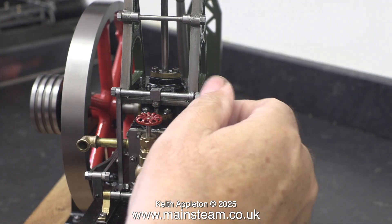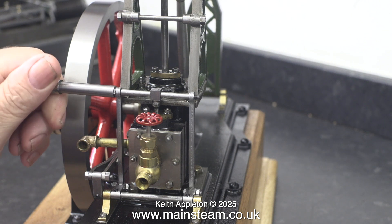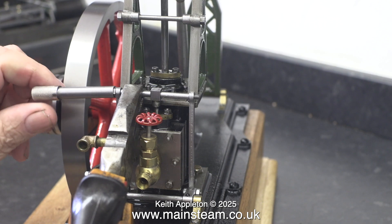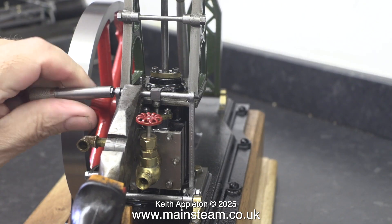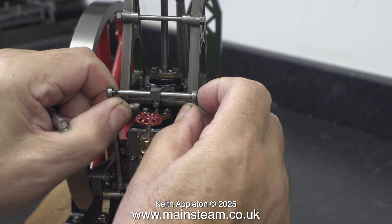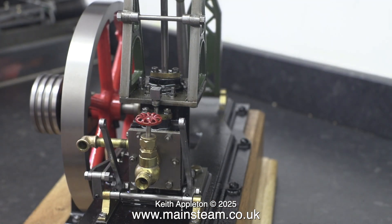Everything is running at normal speed. The first thing to go is the crossbar that operates the valve spindle. To remove the second nut, I needed to hold the spindle using a pair of pliers, but very gently because I don't want to see any telltale plier marks on the spindle. It's easy to prevent plier jaws from marking work: get a piece of brass, fold it in half, then use the pliers to clamp the piece of brass very tightly to the spindle.